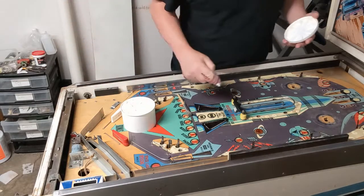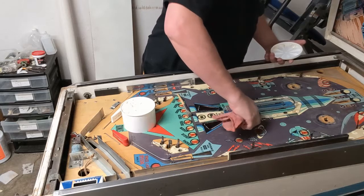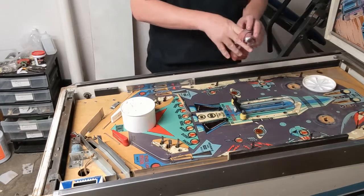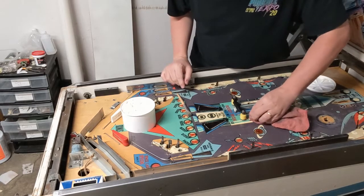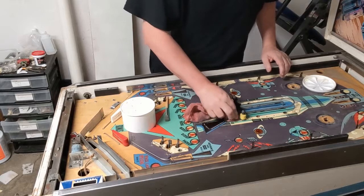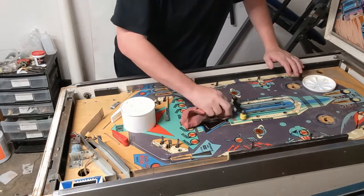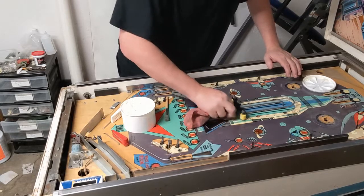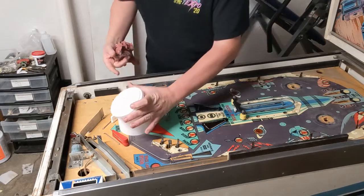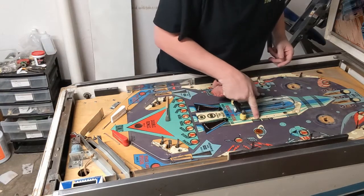Now, Gojo is one of the preferred brands. There's a lot of other brands that you can use, but this does a really good job. It doesn't have water in it that's going to soak in and eat away everything, so it's not going to raise grain or anything like that. It does have a tiny amount of water in it, depending on what version or brand you use. But it also has oils in it that will go through and moisturize the wood without raising grain. So this works really, really well. It's one of my preferred methods. Just waterless hand cleaner, Gojo. Purple Power has a tiny bit more water in it, so I prefer not to use that. But as you can see, it takes dirt off really nicely.